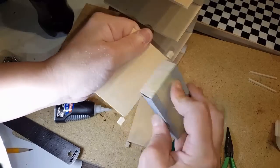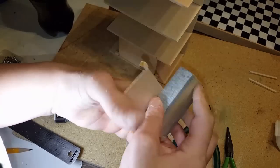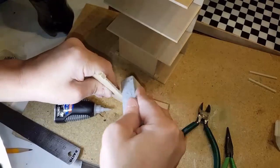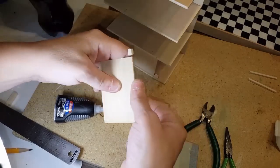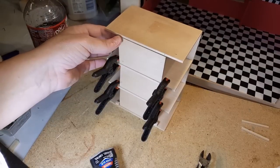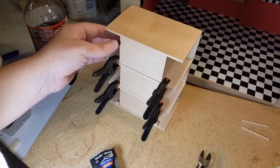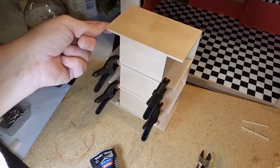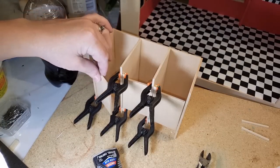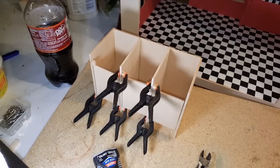The easiest way to round the door back is to just stand it up and sand it. I do this after putting the pins in so I have more wood to work with — that quickly gets rounded. Go ahead and clamp your door. If for some reason it won't open, take a thin piece of sandpaper and sand right here in the back. It should open freely, but if not, just sand it a little in that area.